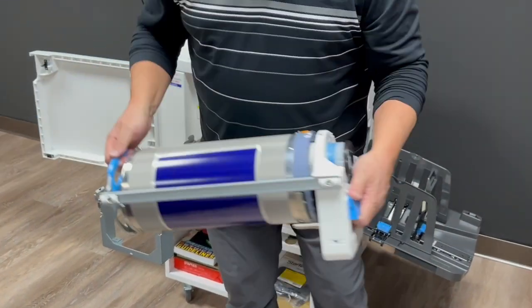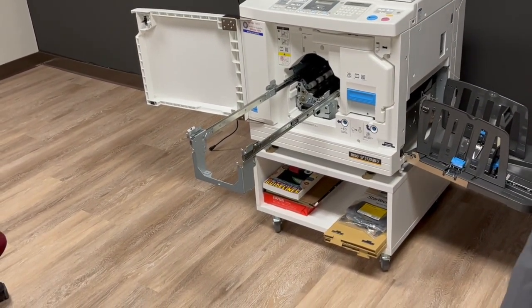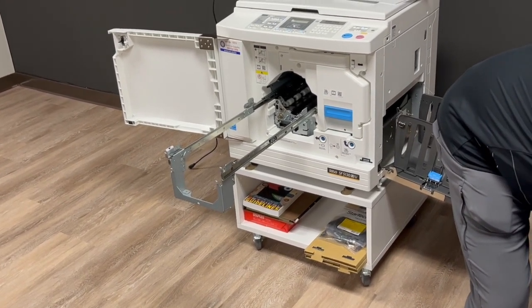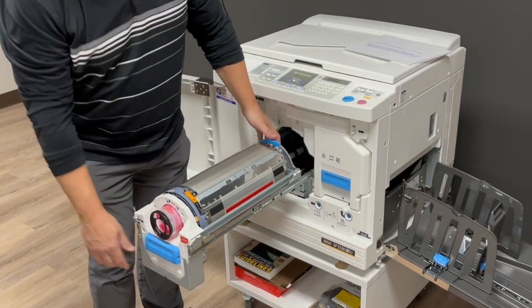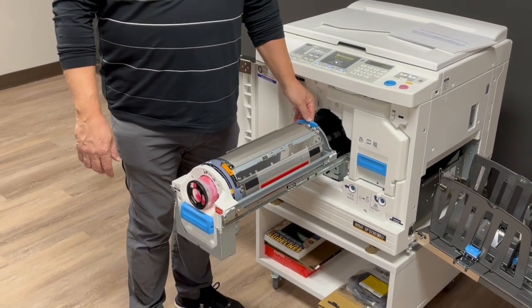It's just like a screen print, except that screen would have taken you about an hour to make manually. This machine does it automatically. It's also very much like letterpress — making sure the ink is spread evenly across the whole cylinder. Just be careful: if you dig into the clips on the end of the drum, it will damage the drum and you'll see it in your print.